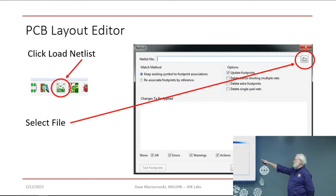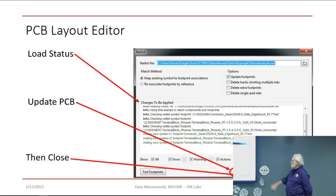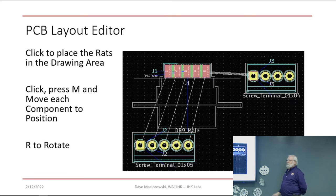And this is what you get — it looks awful. The PCB layout editor knows what the components are — a DE connector and two terminal strips — and what the connections are between them, but it doesn't know where to put them. So it gives you this: it's called a rat's nest. In our case it's simple because there are only three parts — imagine 10,000 parts and needing to figure out which group goes in which corner. We're going to press M to move each part after selecting it, and R to rotate it to get it where we want.